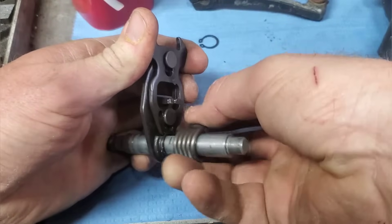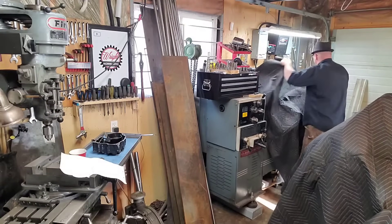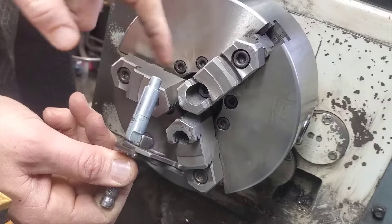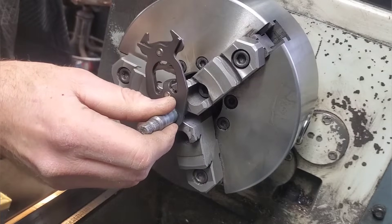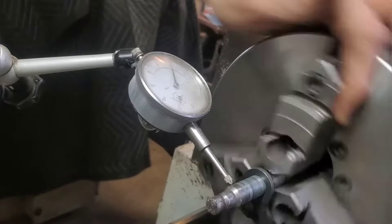Lucky for me there's not too much assembly that goes into this, so all I have to do is slide the spring off and then we can throw it in the lathe. And even better, because this part I don't want it spinning in the lathe, it's actually gonna kind of act a little bit like a drive dog, so I can fit it in there and push it up against the side that's gonna have the torsion.